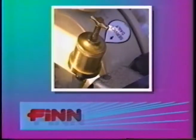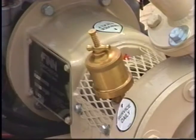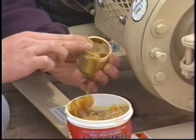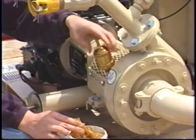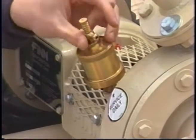When finished, move over to check the automatic pressure lubricator which keeps the pump properly lubricated. Turn the thumb nut clockwise until the stem is fully extended. Remove the cap and fill it with a soda-based grease. Replace the cap and turn the thumb nut counterclockwise until it reaches the top of the stem.